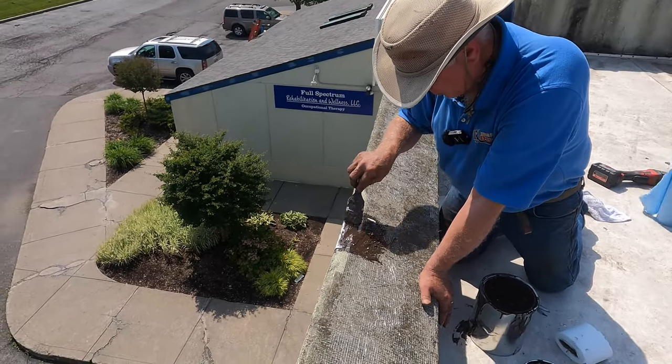Then do a transition with Turbo Poly Seal. Start with peel-and-stick on here — it comes three feet up to there. Go all the way to there, three feet wide, then cut it down at the corner so you don't go up the wall. Then do a Turbo Poly Seal transition like we do. Cut another piece of peel-and-stick, lay it over the little seam, bring it to there, cut it, and do the same thing. I'm trying to help you do it the easiest way so you guys can do it.